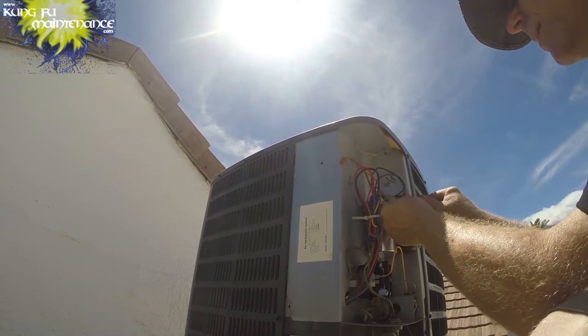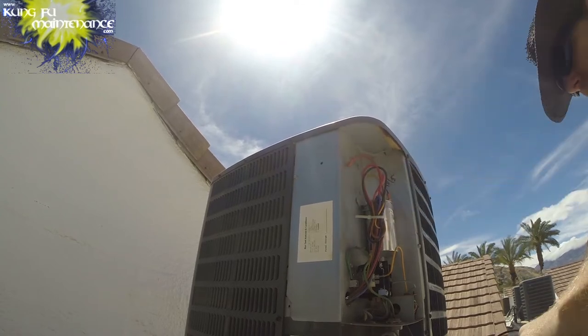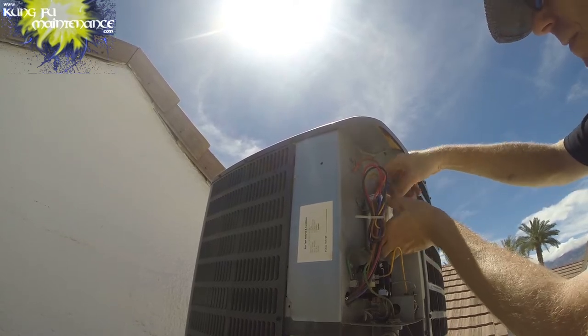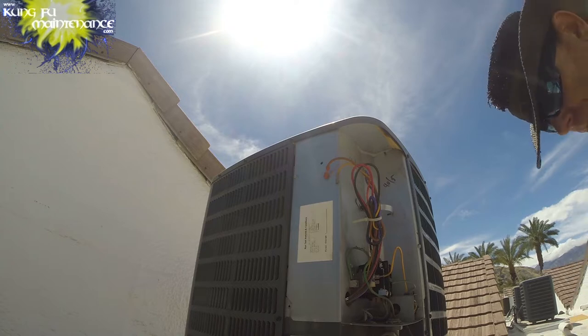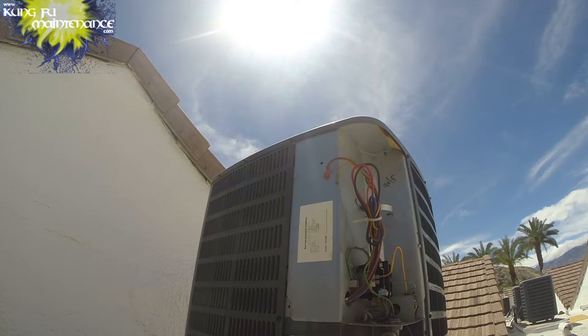So again, back to why aren't I replacing units? Well, it's to save money, and also to keep uniformity in my units. All my units right now are R22 units. Some of them I've been converting to MO99 when I have lesser replacements that don't require the R410 unit or new condenser unit. So if I have to replace an evaporator coil or a compressor, I can just recover the R22, save it for my other units, and recharge with MO99, which is what I've been going with. There's a lot of variations on opinion and schools of thought, but in my opinion, that's been the route that I've chosen, that I think is going to give me the most longevity and be the best for all parties involved. And so that's a little bit of a backstory.